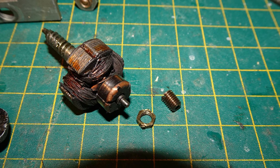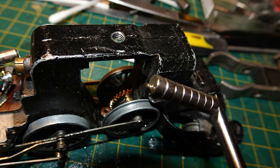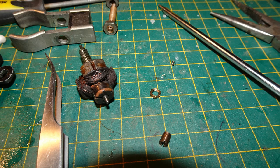The nut is supposed to be screwed on the bearing up against the top of the chassis, locking the bearing in position. Both bearings appeared to have perfectly good balls in them. I used strong magnets to get the ball out of the bottom bearing. I don't know how else you'd ever get it out. So now I had removed the balls from both bearings. You can see the balls here, a little above the centre of this image.